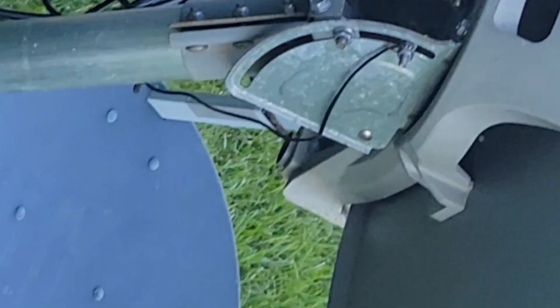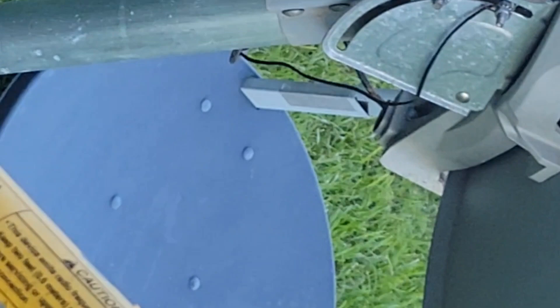That's a hobby - it gets frustrating sometimes. Right there I got that LNB kind of angled back this way a little bit, which makes sense because it's coming more in from the east at where I'm at. You kind of go this way then go back that way when you're going to the west. When I put three LNBs on here, I have one dead center, the one coming in from the east is placed on the west side, and the one coming in from the west is placed on the east side - because everything angles. That's how I got my angle right.